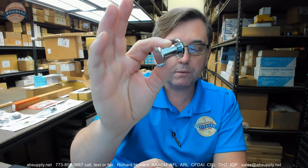When you install this item, you're going to want to drill a hole. Whether or not you drill all the way through the door is up to you, but I don't recommend it — because as you breach through the other side of a wood door, you can tear or flare out the wood fibers that make up the veneer. You don't want to burst through the other side or chip part of the wood, since there's not a lot of room on the outside dimensions. Drilling from either side is how I like to do it because it gives a really clean hole. A nine-sixteenth hole saw might be nice, or a fly cutter, a spade bit with outside cutters that score nicely, or a Forstner bit for a very clean hole. The issue with drilling from either side is you must make sure you are drilling in the accurate location on either side.